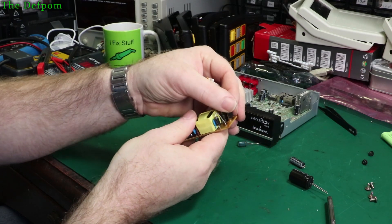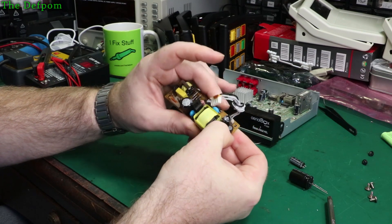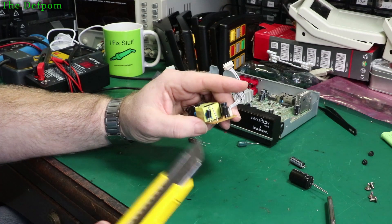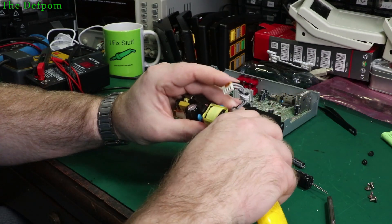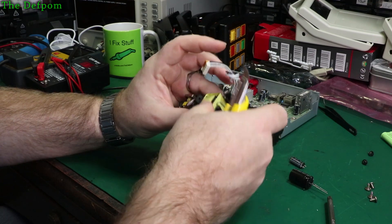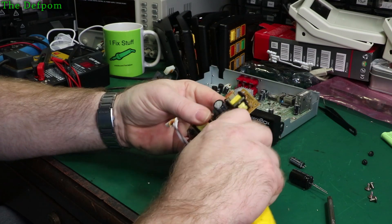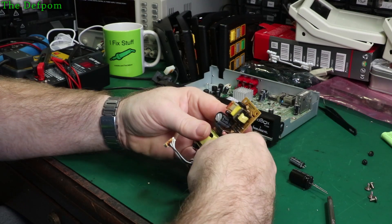This adhesive - I see a lot of it on old PCBs. It tends to corrode component leads when it gets old. This has gone quite brown already, so I'm suspicious this could also be a bit of a problem. Because what happens is when it gets old it starts to conduct - it gets conductive. Which is exactly what you don't want on a high voltage power supply. I need to get rid of some of this without cutting through the component leads. It doesn't really need physical reinforcement - what it does need is to not be eaten through by the glue.